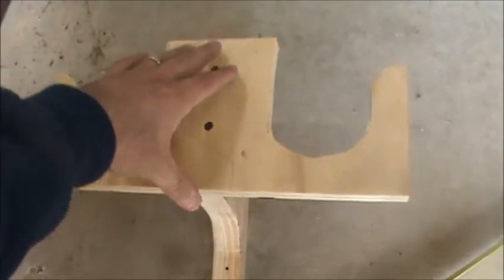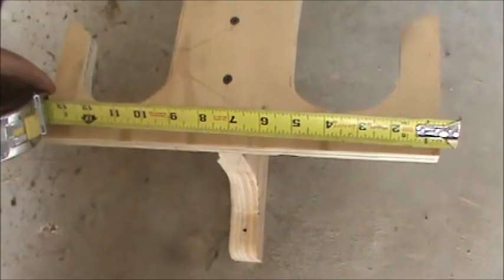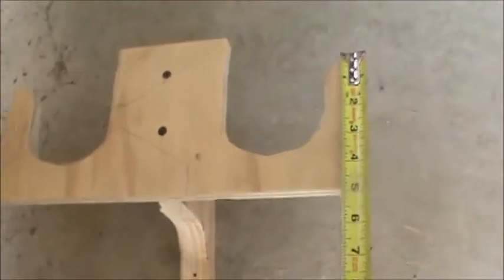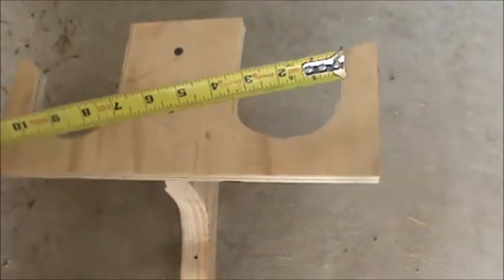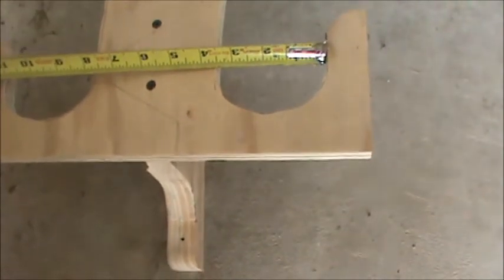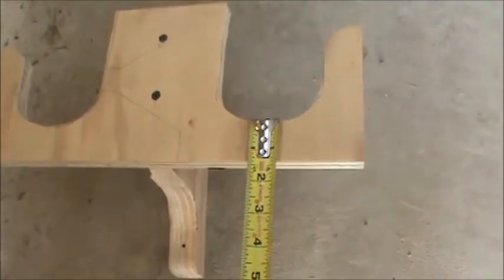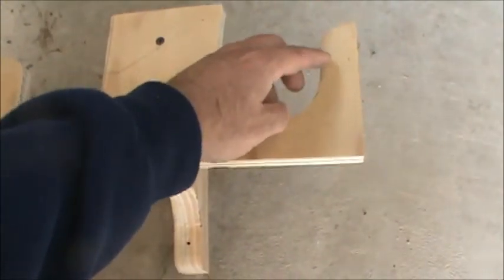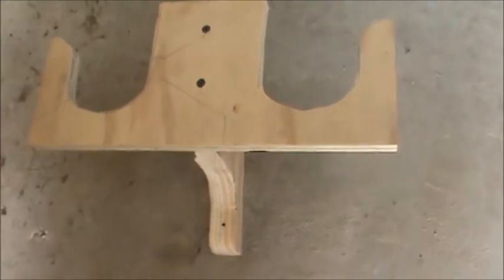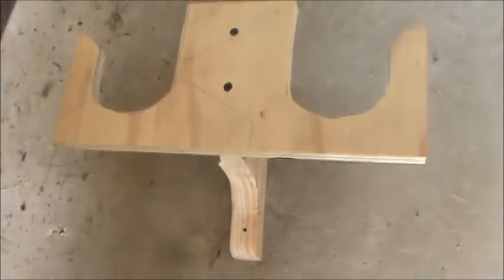This is three-quarter-inch plywood — I use that just because it's more stable. And it's 14 inches long. This distance is five inches; it's the same on the other side. And in here is three and a half. And the bottom of the radius is an inch and a quarter. All those measurements work out really well. You don't have to make this so high up — you can make it shorter if you want, your chainsaw won't fall off. And this is glued and screwed with three-inch drywall screws.